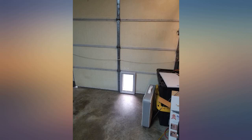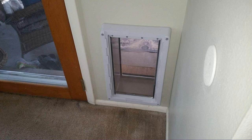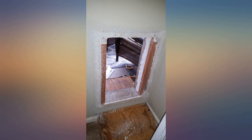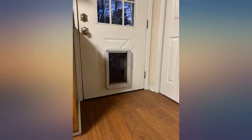I purchased the XL door and also wall installation kit. This was the closest size I could find to match my old dog door of 24 years. Basically I made a bigger hole smaller. I built interior framing to make it 2.5 inches narrower and flat was taller. Good for my big old 100-pound lab.